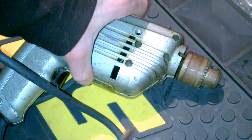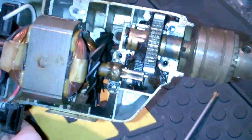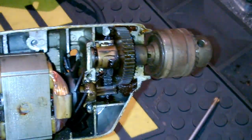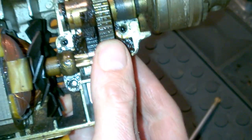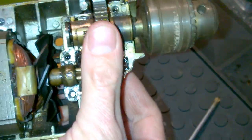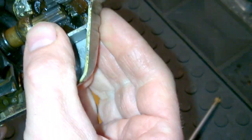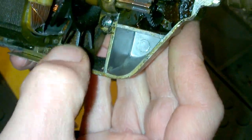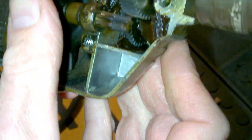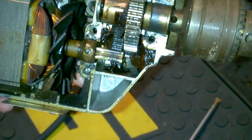A few more screws than I thought. Let's crack this open and see what we got. It looks pretty good on the inside, to be honest — not dirty at all really. The gearing up front looks good, nice solid metal design, the chuck spins well. The grease is a little bit tired, not terrible, and the gears are moving pretty nicely — that's a good sign. No broken teeth in here, nothing floating around. The rotor is encased, there's a nice metal fan, and the rotor is connected to the gearing with what looks like a bronze or brass bushing or sleeve.